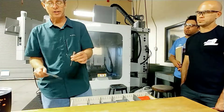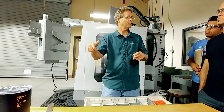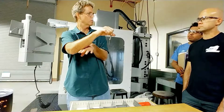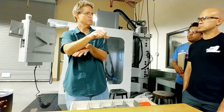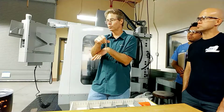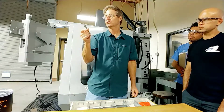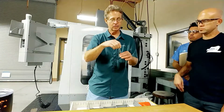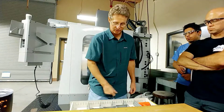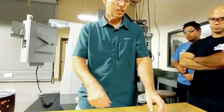They are handy — you can get them going nice and straight. I've had situations in my shop where I had to basically crawl on the table with my hand wheel and indicate a certain little feature, comparing it to another one to line up dies. Sometimes you don't have real clear indicating points on tools, so you can use them for all sorts of things. But just be careful — they are a sharp point and once they go off center they can do a whole lot of damage.